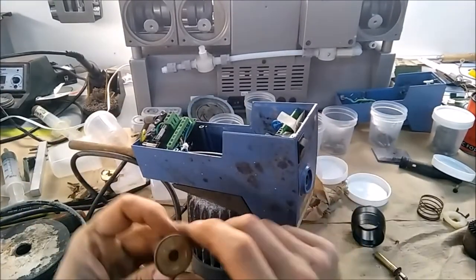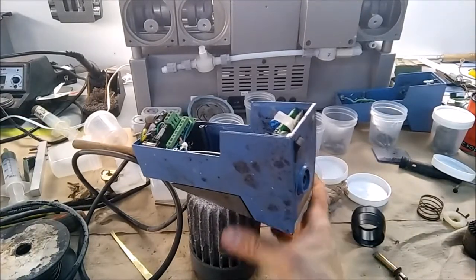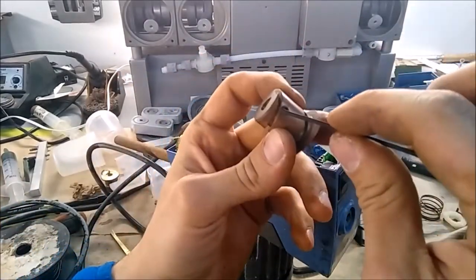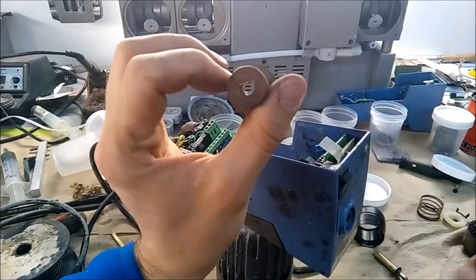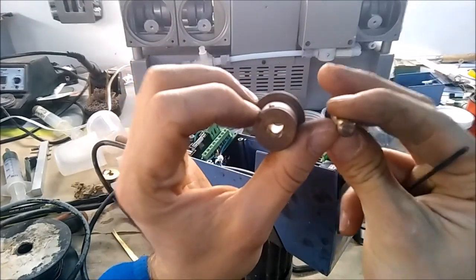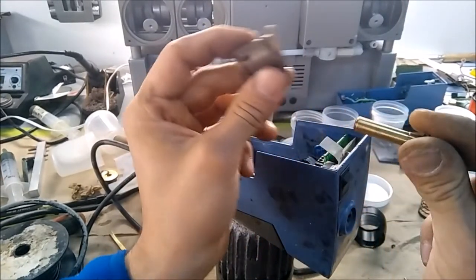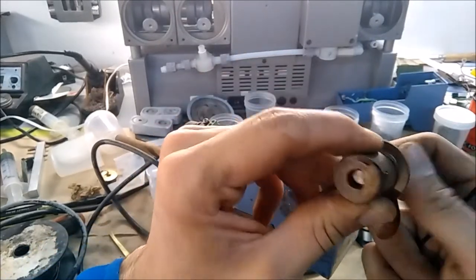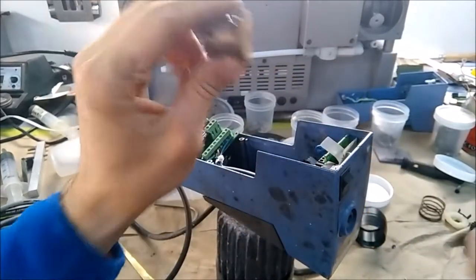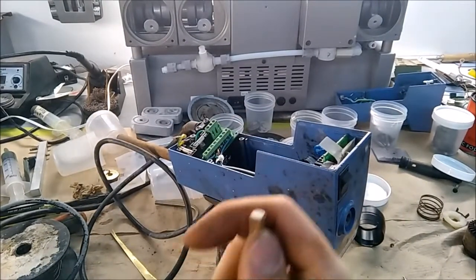I've given it a little sand and wiped it out — now it's moving freely. I'll lube this up with some white lithium grease before final assembly. The spindle is out and you can see the set screw profile: it's got a flat shape that lines up with the flat shape on the bore. When putting it back together keep that in mind — if it's not lining up you probably don't have flat to flat. Also do a test fit first because if you had to hammer it out you may have deformed the back end slightly; just run a file over it and it'll go right in.